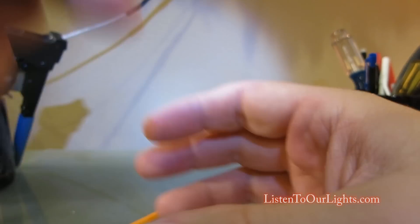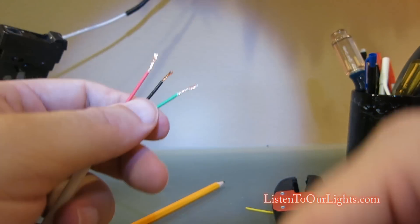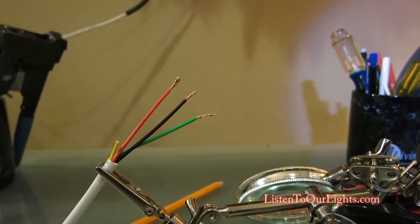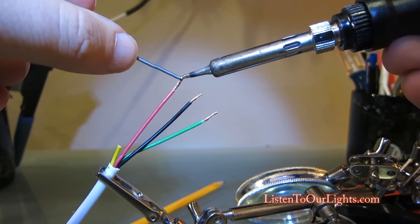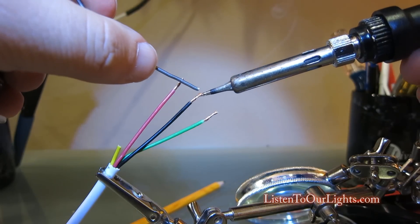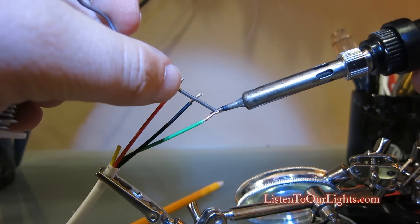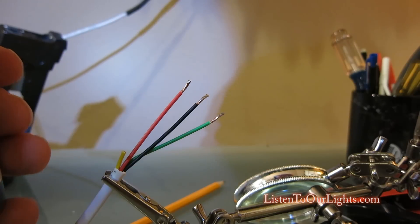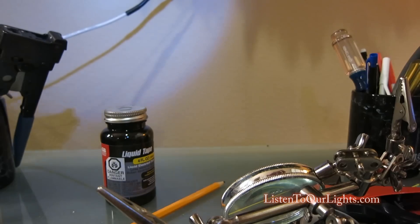I stabbed myself. I pick the side that looks like the longer side — these are the ones I'm actually going to solder in; the other side will go into the connector. I'm just going to tip the ends with solder so that they don't unravel on me. You don't have to do this — it's just to keep the ends from fraying. I put a little dab of solder on each end, then flip it over and go to the other side.